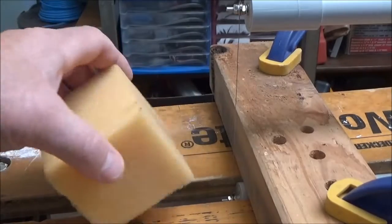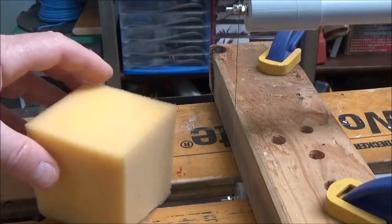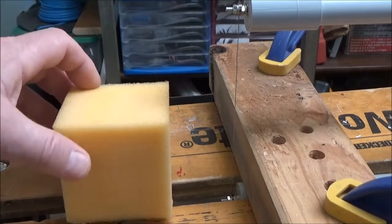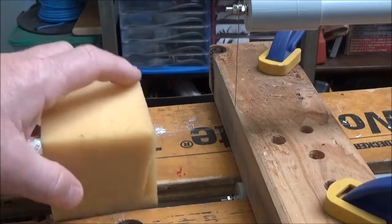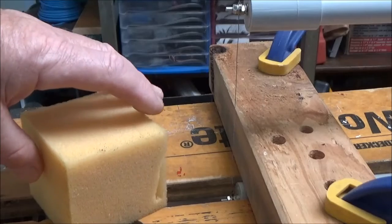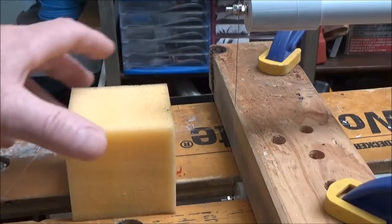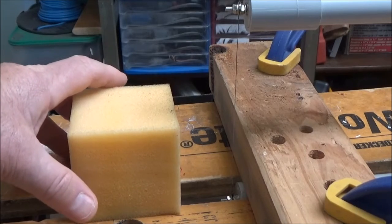Now we've finished up with a fairly good sort of a cube here, and I think the first thing I'll do is try and cut out the height I want. So remember that the depth of the wagon was 17mm, so I'll use my original flat surfaces that I had from the product itself, and this is one of them, because I know they're dead flat, and I'll use that as a guide to cut off the actual depth I want. So 17mm, I might go, I don't know, a bit over 20mm to get the initial height, and then we'll work on it from there.